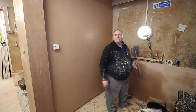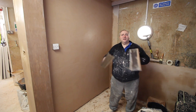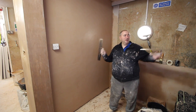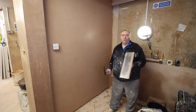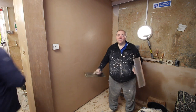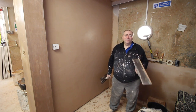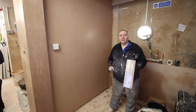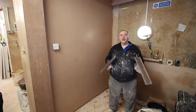Well, that's it. If I was on a job, I would be doing that wall and that wall at the same time, so it would be setting quicker. If I was doing two walls at once, that pail full would have done a first coat on both the walls. Then I'd have washed the pail down and remixed and second coated them all. Cleaned the pail out, troweled it flat right away, and then gave myself 15, 20 minutes and first polish, and the other time at second polish. So it's just basically all on the pace, how fast you get the stuff on, to how much time you can sit about. With that being a small wall, you're waiting more than anything else, you're standing about waiting.